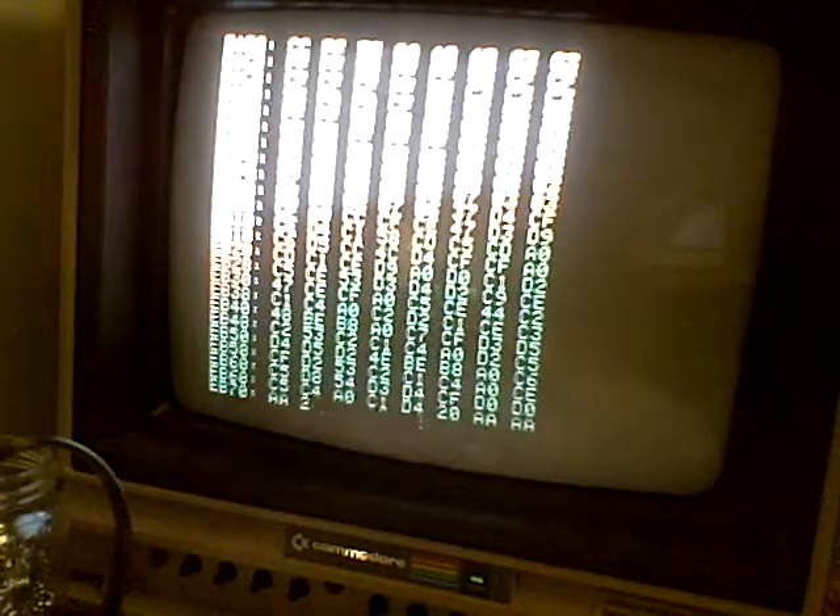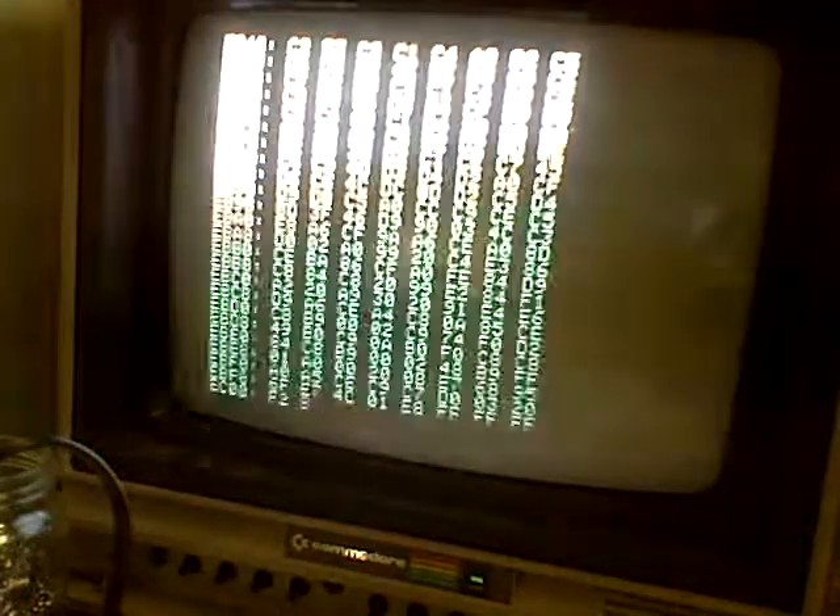I did make some mistakes. I'm going to go ahead and post the earlier video that I made, which was wrong, but I'm going to put it up anyway because there were mistakes made because I didn't really understand the address decoding and the chip select. But now I think I sort of understand how it works. I'll feel a lot better once I get BASIC running, but for now still trying to figure out what the issue is. All right, I'm over time.